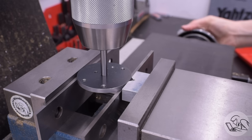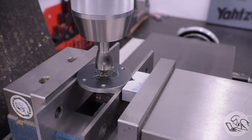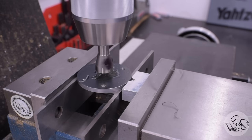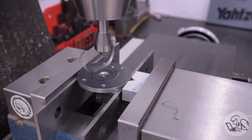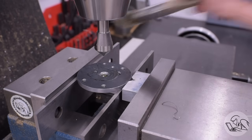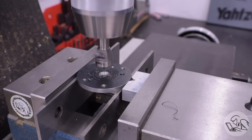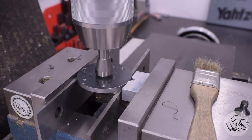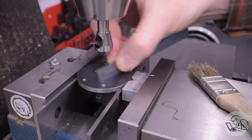The God of Machining has shined upon us this day and we really nailed that fit — there's a little bit of luck involved. I thought I was going to have one more cut but I test fit it and it was right on. Finally back to the mill one more time. I'm going to line up on the hole in the center with a gauge pin because we need to do that big countersink that goes here. For that I'm going to use my zero-flute countersinking tool, which I love. I wanted to do this chamfer at the end because I wanted as much material on the mandrel as possible. Zero-flute chamfering tools are one of my favorite things — they do such a nice job and they don't chatter. The secret is lots of lubricant and run them very, very slow. They do plug up with chips pretty easily, so I have to stop regularly and clear out the little cylinder area in the middle. I went by trial and error a little bit at a time until that bolt sits nicely just below the surface.